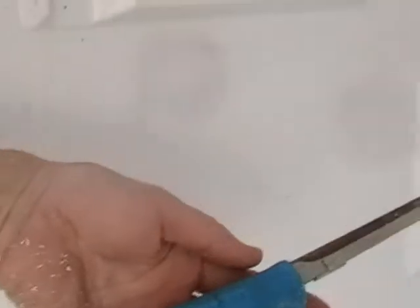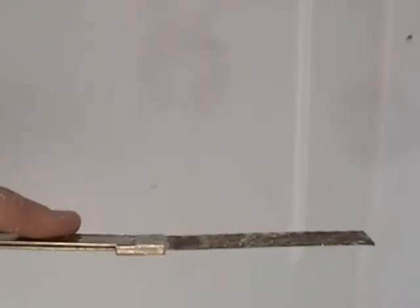I just took this little hand blade — it's a handle that has a clamp on it for a regular little saw blade, and you just clip that on. Bill used it to install telephones, to put the boxes in the walls. I use it to saw drywall to put a medicine cabinet in. It works really well on drywall, and it works pretty darn well for this too.